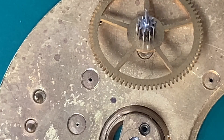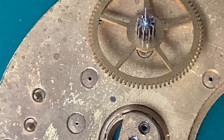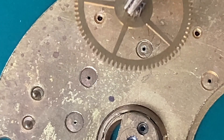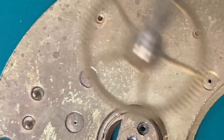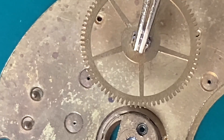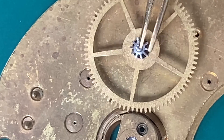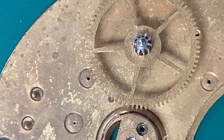This wear is usually caused by lack of lubrication or lack of cleaning and proper maintenance of the pocket watch. The watchmaker also found on some new watches that the pivot holes needed to be closed because they were improperly sized at the factory.